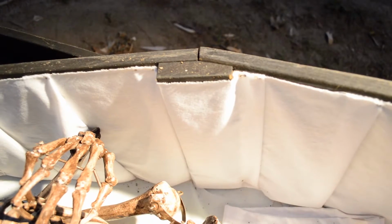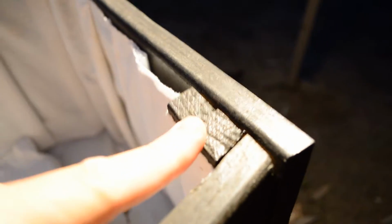One thing that's important about making coffins is there's always got to be all these little posts that all these boards are going to nail to, otherwise how would they fit together? Usually coffins are made 2 boards high, and all these boards are running lengthwise. Then you put boards across the back in a couple places, 2 to 3. I think this one has 3 to hold all the running boards together. Kind of the same thing here. You can see there's these boards all the way across it that hold the running boards together.